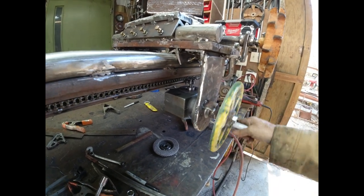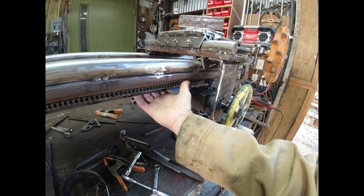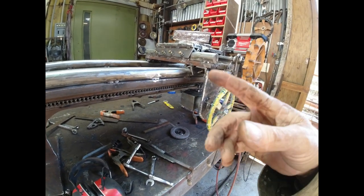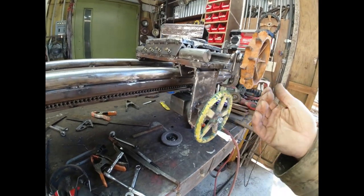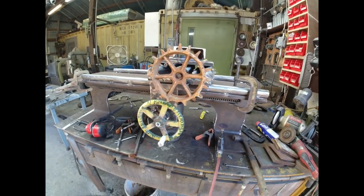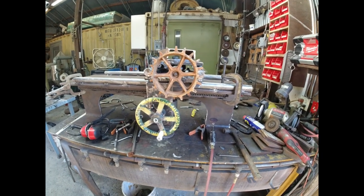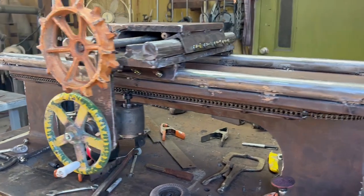And I think, you know, it's got that angle iron. I think I'll weld the angle iron a little bit, enough. Turn the whole thing over and drill it and bolt it with oversized holes. That way, I'll be able to have some adjustment. Right now, I just have a clamp on each end, and it seems to do okay. But I think if I put a bolt about every 6-8 inches, ooh, that's a lot of drilling and tapping in that 3/4 metal. But starting to get some serious weight on this thing.